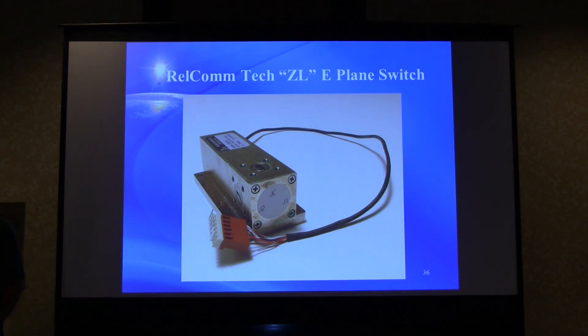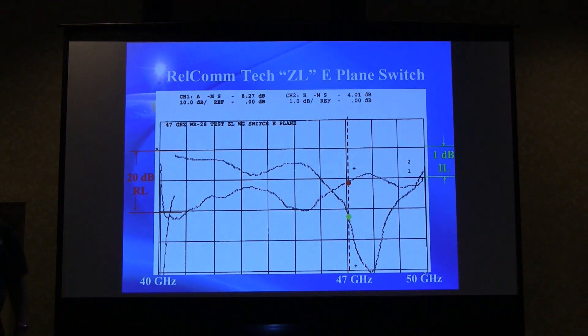Some beautiful little WR28 switches from New Zealand operating on 8.2 volts — tiny, and seemingly ideal for 47 GHz — were also tested. Unfortunately the insertion loss is over 3 dB, and this has been verified by others. The return loss is similarly very bad at about 12 dB. So these switches are totally useless on 47 GHz. They work well on 24 GHz, but for 47 GHz they're really disappointing — it would have been great as a low-power switch.